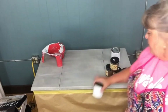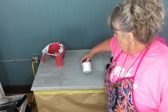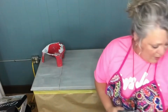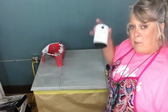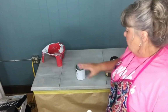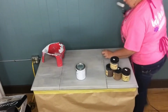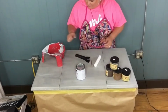and I worried about releasing tannins and things like that from underneath. And I think there are a little bit of brown spots maybe there. So I did use their Boss blocks out stains and stops bleed through primer on here. But if your surface didn't need that, the Johnny products don't require a primer. The Dixie Belle products don't require a primer. This particular top just required one because it's old and damaged. So probably won't be able to see my head from back here.